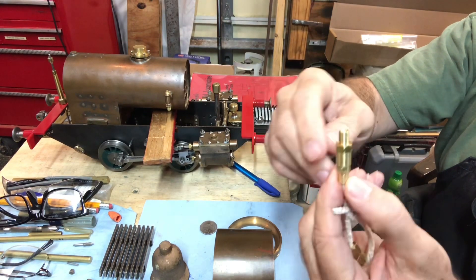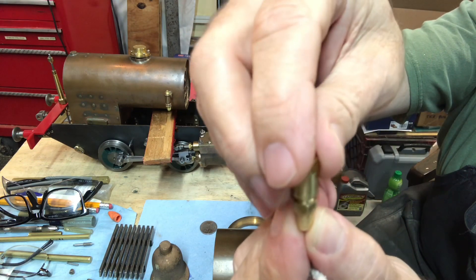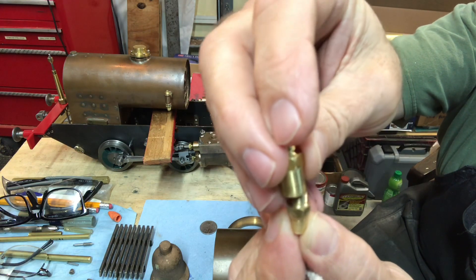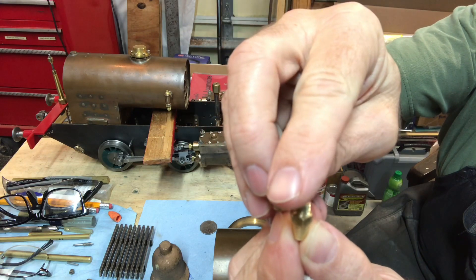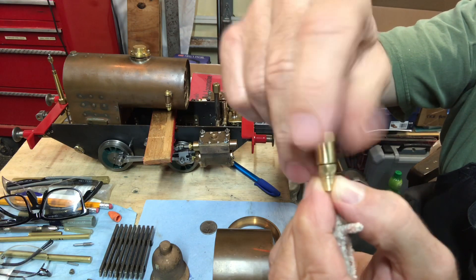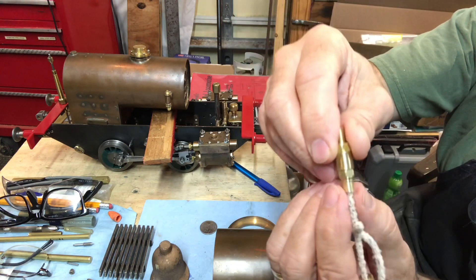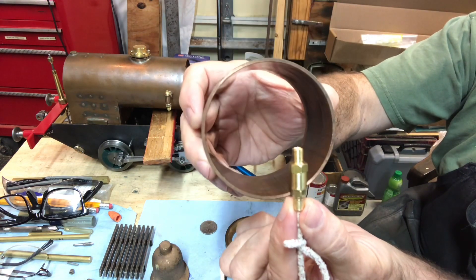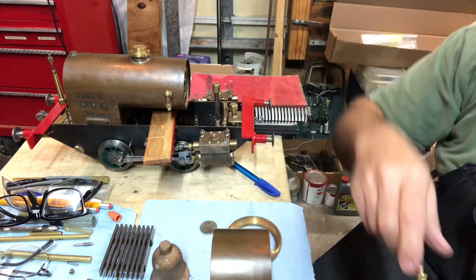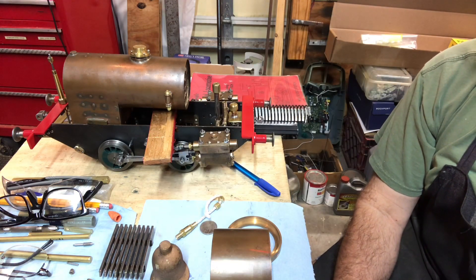We'll wind up this week's short episode with a little view of the finished snifter valve. Take the top off and I'll show you the little stainless steel ball bearing I've got in there — it's a 5/32 inch ball, which is a little larger than the eighth inch they call for in the plans, but it'll definitely work. Put that all together. As you can see here, I've got the little nuts that we just made — I keep them on a little pipe cleaner and that'll all go in a ziplock bag. Just to orient you to where this will sit: here's the smoke box and it'll go inside the smoke box something like this. Thanks again everybody — if you would, pass the word, give me a thumbs up, ask any questions if you have them, I'll do my best to answer. Hope you all have a great week. Thanks.